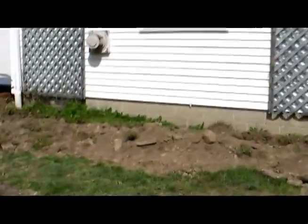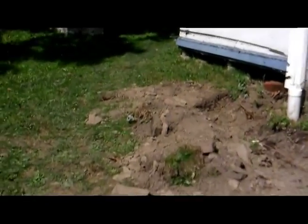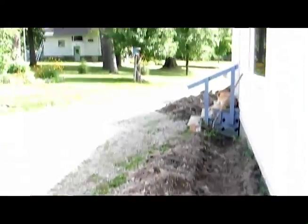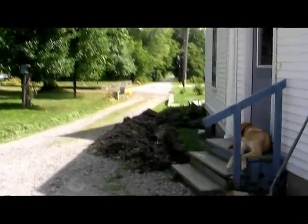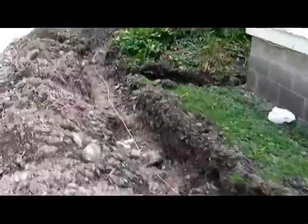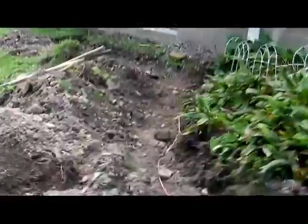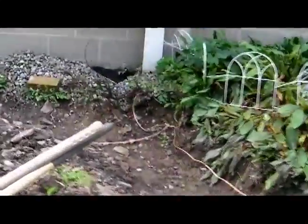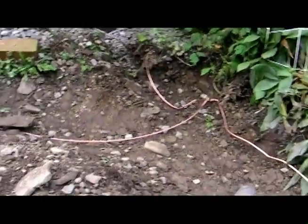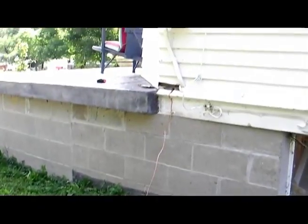There's where my coax will come through. So we'll walk around the house here — I've got a total of about 150 feet of wire, which they recommend if you go around your house like this. Ground telephone to it and anything — any kind of cable that's going into your house should be grounded. It goes on down the driveway here and will connect to a ground rod right here, which is my station ground. Like I said, that will run into a bulkhead in there — I'll have a copper plate and all my equipment inside will be grounded to that. Then it goes on down to the utility ground.